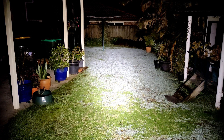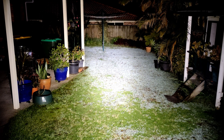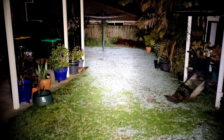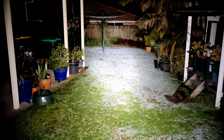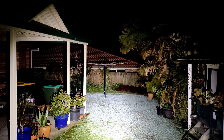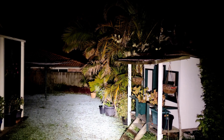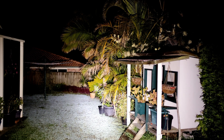Overall it's only about $20. It does have that quirk of the USB Type-C port, but it's excellent build quality and handles heat very well. If you're only running a small amperage LED you'd probably just go for an S2, but if you're running something like a 6-volt LED and need the 22mm driver spot, this host is an excellent choice. That's definitely highest mode — that's a lot of light, around 3500 lumens at 4000K. I could leave this on for quite a bit of time and it doesn't even overheat. I love this host. I think I'm going to have to buy one of the K1B to see how it does without the USB Type-C port.